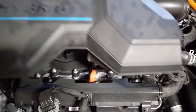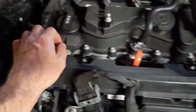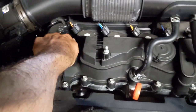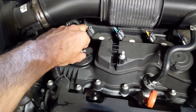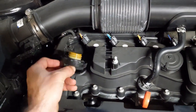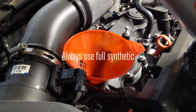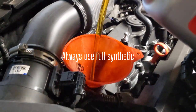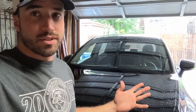In order to add more oil, you will have to pull this cover off — it's fastened down on top of these little clips — and then you have access to your oil fill right here. The dipstick is accessible without taking this off, but if you're going to refill it you do need to take this cover off. Keep it clean and go ahead and put the oil in.